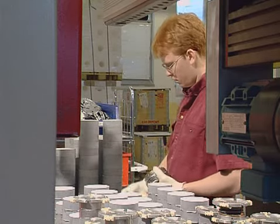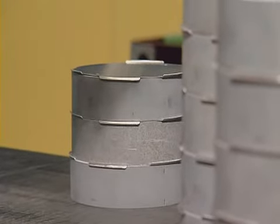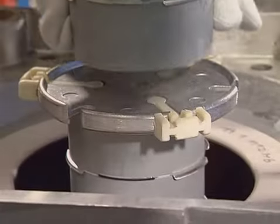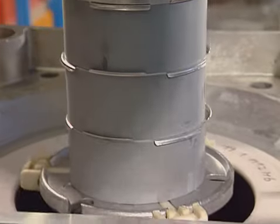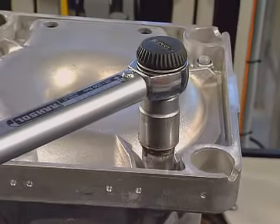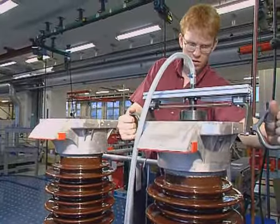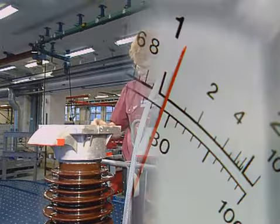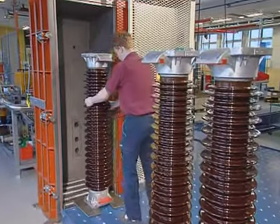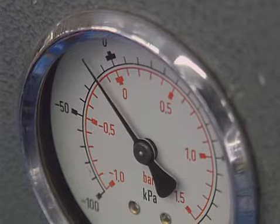During pre-assembly, the constituent blocks are stacked with spacers based on the electrical design of the respective X-Lim unit. The height of the interior is remeasured, after which the unit is equipped with a sealing cover on each end. Before the leakage test, the unit is vacuumed and filled with clean, dry air with a small quantity of helium. A helium spectrometer is used to detect any leaks.